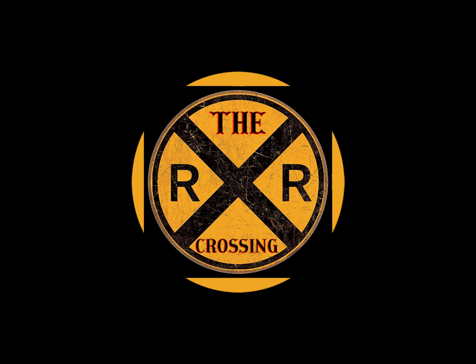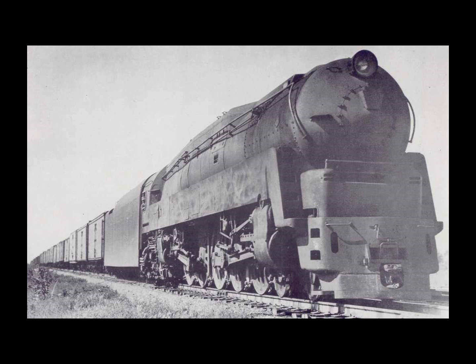With that, let's get on with the story today, which is the Pennsylvania Railroad's duplex Q1 experimental locomotive. I thought I would start the story by asking: why did railroads want to develop these duplex type locomotives? Duplexing is entirely experimental in the United States, and it has some advantages that solve maintenance issues, especially with the track. The main disadvantage of two-cylinder locomotives is the heavy hammer blow on the rails caused by balancing the reciprocating parts with additional masses mounted on the wheels.